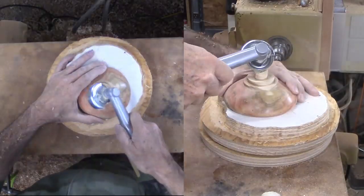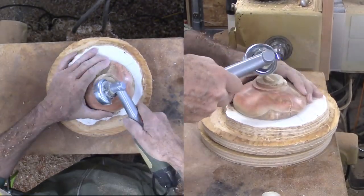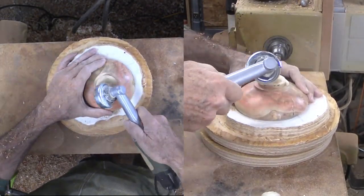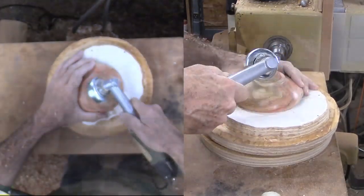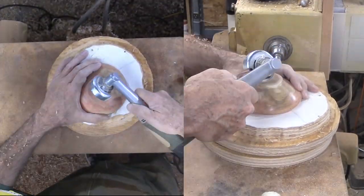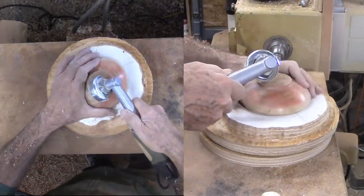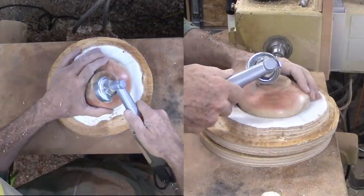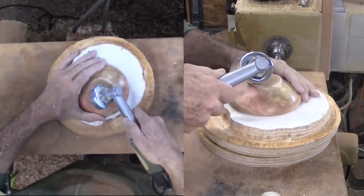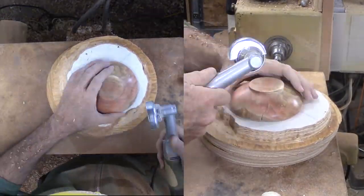Now I have the typical problem to address, the foot. The only differences are the area inside the foot area is a bit larger and, more significantly, I cannot reverse mount due to that nail. So I'll grind off the wood with a rasp cutter in my right angle tool. I'm using the plugs from the hollow log to protect the nail. I swap for a sanding head in the right angle tool to smooth the wood from the rasp.